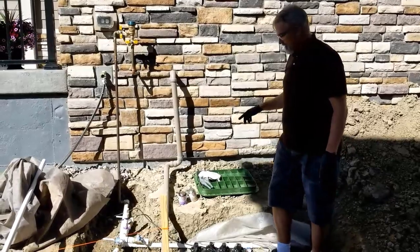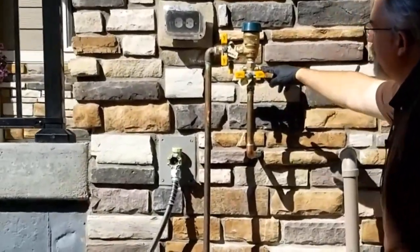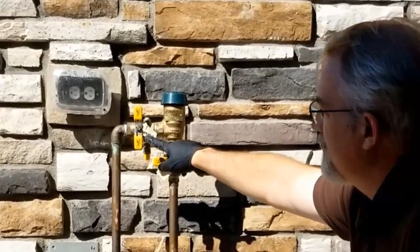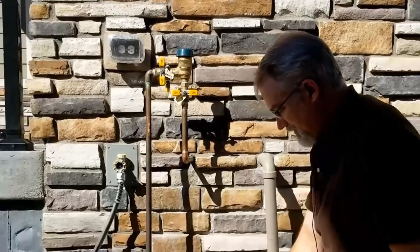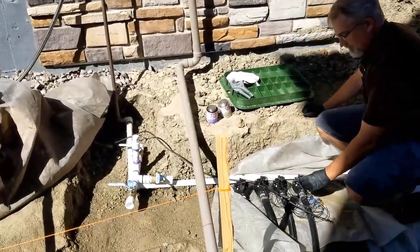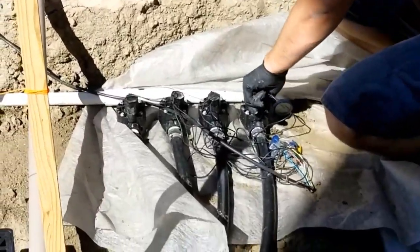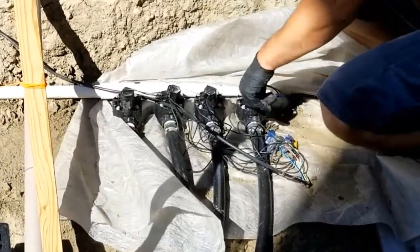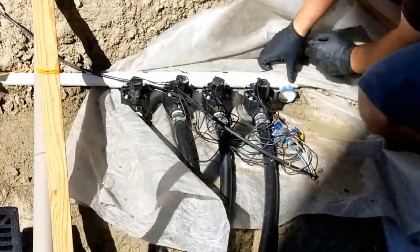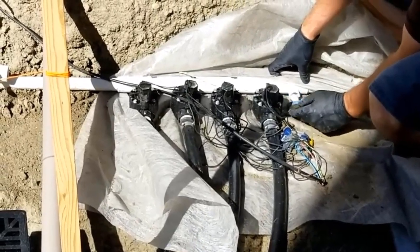That's shut down. But also I came up over here and I've shut these off. If you don't know, whenever you have a valve, if you cross it, based on where the pipe is, that's shut off. So I shut that off. And then these, even though they're electronically controlled, you can, in this case, open them up like this. So I open it up to let the pressure out. And then lastly, we've got this little valve here. I'm going to open this up and let the last of the water out, which there should be just a little bit to trickle out.